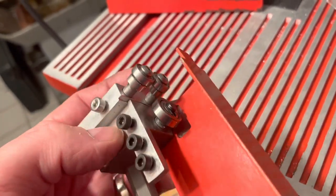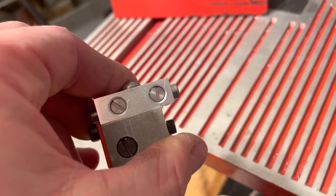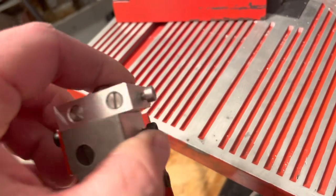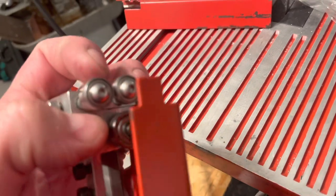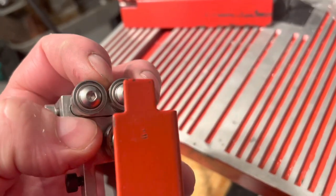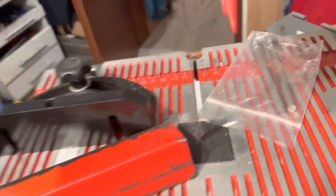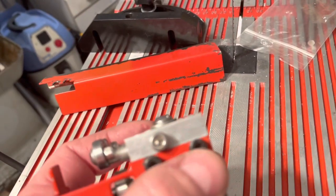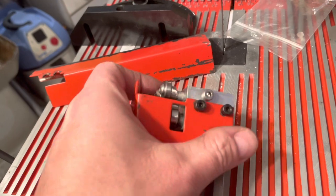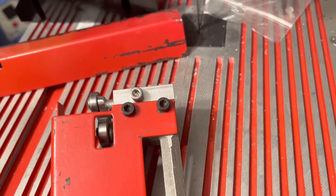And then you have the two roller holders in here. They also got slotted in the back so that you can easily adjust them. You can slightly tighten these here and then use the screwdriver to finally align them in a way that they both are sitting tight here at the blade. What was nice is that the housing was still fitting. I just had to take off a small corner down here, and the other one is actually still working.